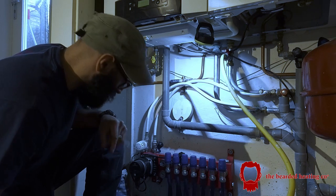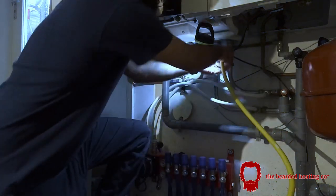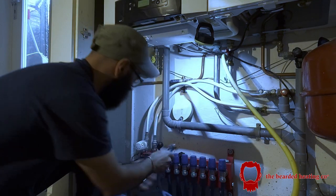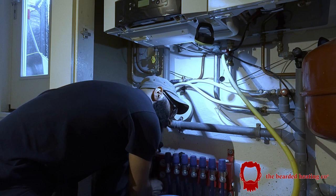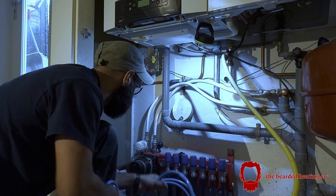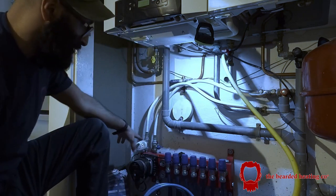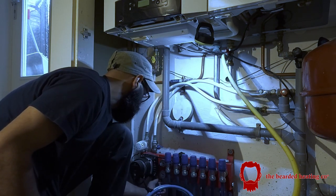Where do we start? What we do is, first of all, down here is a drain off. That hose pipe can stay. I've got my own hose pipe here. Screw that on to the drain off. And well, I suppose actually, yeah. If I isolate that and I isolate that, I'm pretty certain that the underfloor heating is isolated. So he says.